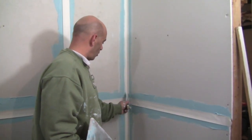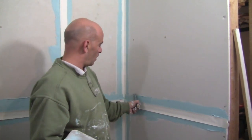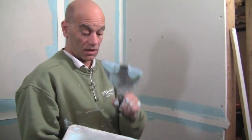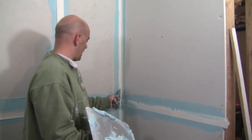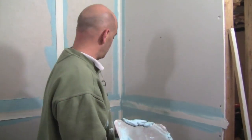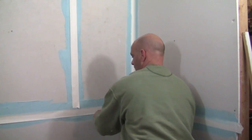Now we're ready to take the mud off our flats. Same way as we did the inside corners, except we're just going to hit it all at once — nice and flat. You can see there's some extra mud there. Sometimes you can knife it and cover it. We put a little too much on — just take it off. It's the first coat; they're easy. I already spent more time on that one than I need to, so let me just go ahead and do these real fast.